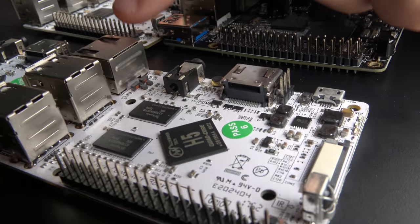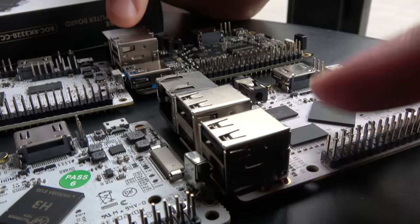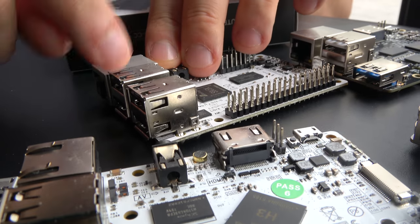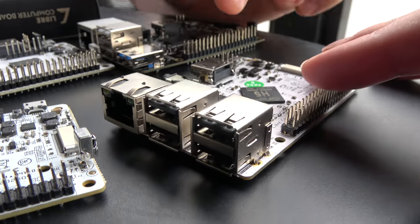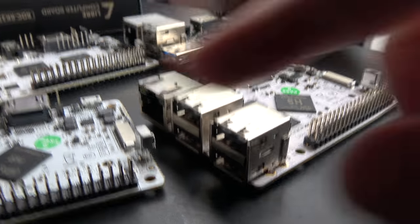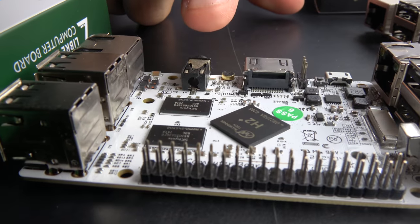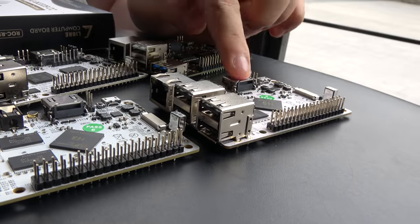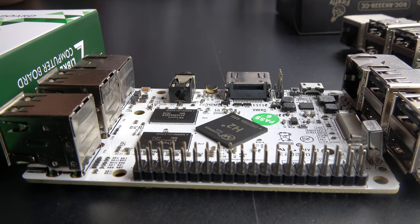This board has an additional microphone, 100 Megabit Ethernet, and four separate USB channels. The Rockchip board has two separate USB channels plus a USB 3 channel. The AllWinner H5 is the higher end of these three. The differences between H5, H3, and H2 boards: H2 comes with 512MB RAM, H3 comes with 1GB, and H5 comes with 2GB RAM. H5 is also 64-bit.